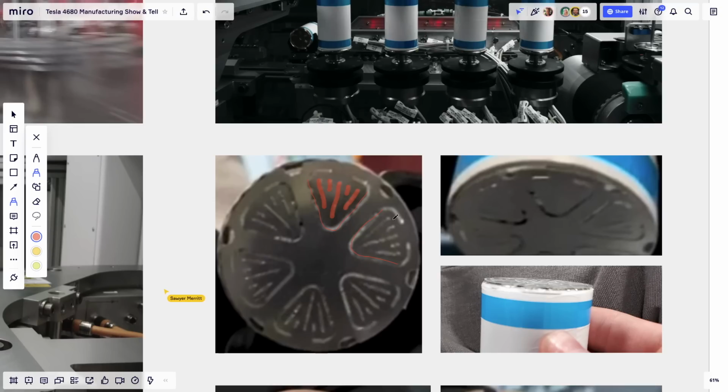So here you can see another laser weld, that's a laser weld, and so on and so forth. What I want you to notice here is that all these V's, I'm not going to draw all the laser welds, are welded to the aluminum flags of the cathode side of the battery. All these little V's can't come off. But then I want you to notice the geometry that this has. All this is welded.